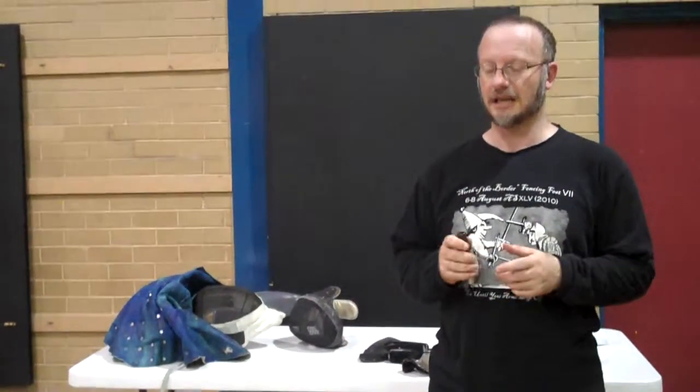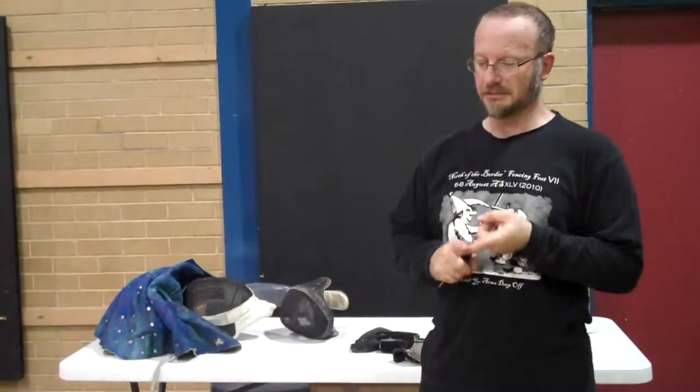I'm just doing a quick presentation to help people with their training on how to use a mask tester. We're required to test a mask once every 2 years, or at any time that we feel or identify that there is a problem with the mask. It might be an apparently broken weld, a really bad dent, or just that one of the wires that makes up the mesh is a bit squished.